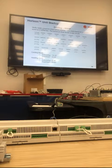And this is just a quick chart for water source heat pump. Last week, it was brought to our attention that the pressure ports we use to measure pressure drop across the supply and return. Instead of using the pressure gauges, we're going to flip to PT plugs. Yeah, we're going to be switching to those very shortly, to get rid of measuring based off the pressure gauges and use those taps themselves. Basically this chart just tells you the PSI drop that you need, based on the model, so that you have the proper water flow. So that should help you.